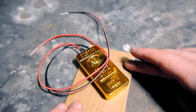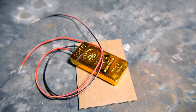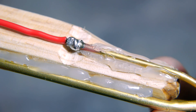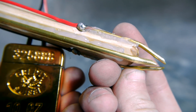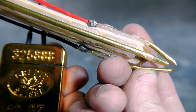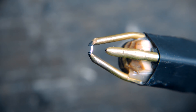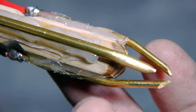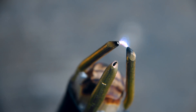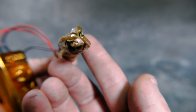With the lighter properly converted to act as a power supply, the rest of the design is quite simple. Both output wires are soldered to a short length of brass brazing rod. Each wire and its corresponding rod is then glued to a piece of wood, which will act as the pen's body. To create a spark gap of roughly 1-2mm in width, the brass outputs are bent toward each other at the end. In order to allow functionality as a torch, a narrow brass tube is affixed to the top of the pen, bent downward at the front to blow air directly at the spark gap.